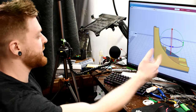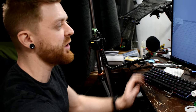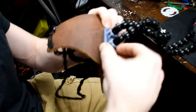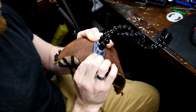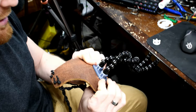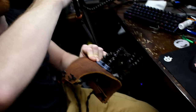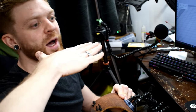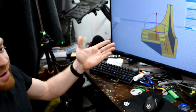When you do this lay flat, it'll calculate it — and that was easy for it. It'll lay it flat based on the general orientation you have it in. If you turn off the snap rotation: when I was trying to print this I was trying to be fancy, which was stupid. I extruded it at an angle to basically make it higher over here, which had no real point other than making the screw threads less. Because of that, and because I just arbitrarily sliced a bunch off, there was no flat bottom — it was kind of at an angle. When I dragged it in here it was some random half angle.